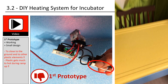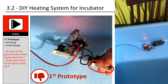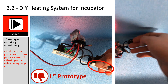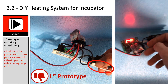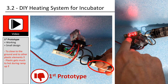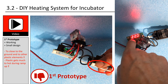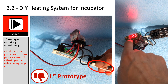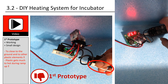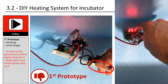This was my first prototype. It already worked. The design was very small, because I did not want to use up much space. The problem is that the heating element normally has 50 watt, which means it can and will get hot very fast. This fast ramp up leads to a local heat spike and that resulted in heat damaging of the insulation box. You also see how easy it is to set up the target temperature. In this design I already included strain relief.